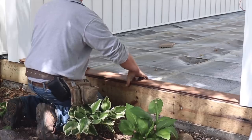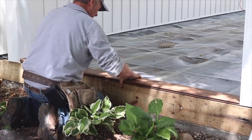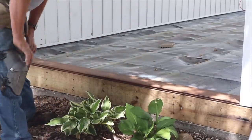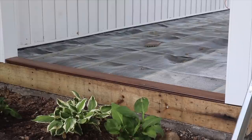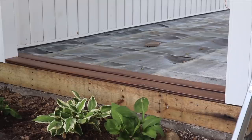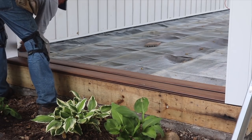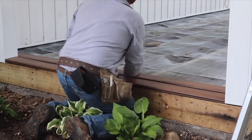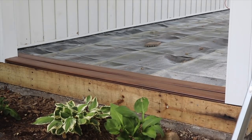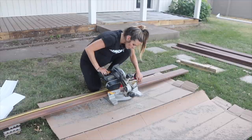Now it's finally time to lay the floor, and this beautiful color of composite decking is manufactured from Armadillo Decking. I've used it before in my video where I built our front steps, so the back porch is actually going to speak to what is currently in the front of the house. The decking is so easy to use as long as you have your prep work done. Building the joist system was important because this stuff is made from 95% recycled plastic. It can be heavy, but it's also a little bit pliable, so it needs a lot of support for it to feel sturdy to walk on. I go into a lot more details about the specific installation of a composite decking material like this in my video of building that step.